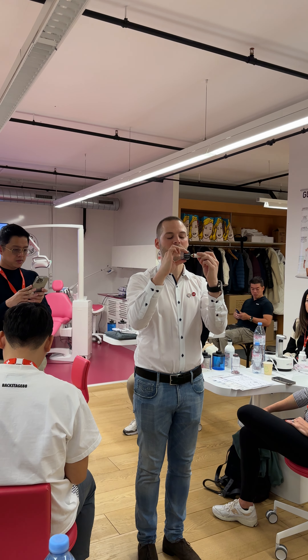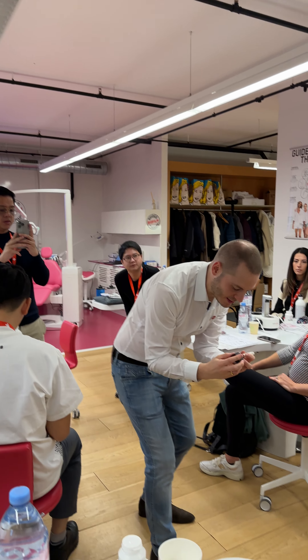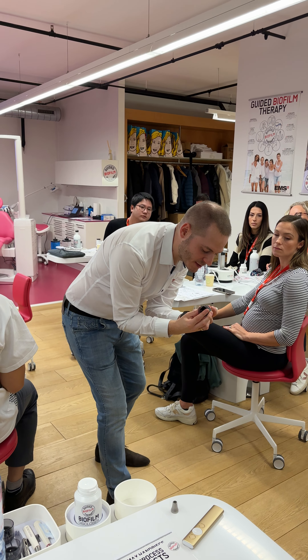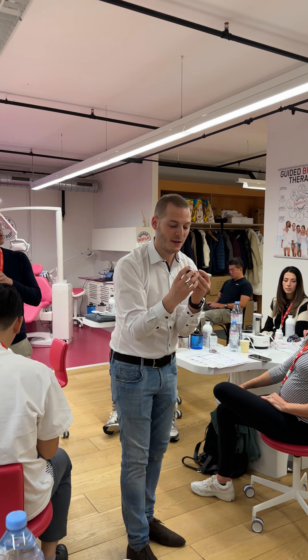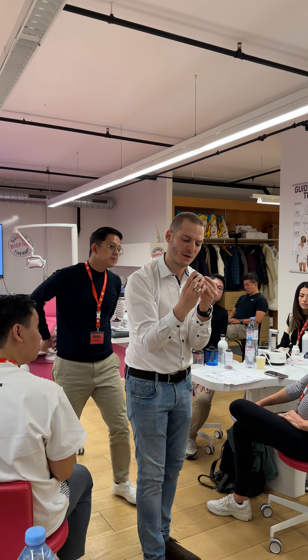Now when I push the instrument on top of that, I don't have a chance to reach the end. So I still have a distance here, because I have one thread with eight windings. So I can touch now the first two windings. So it tells me that my thread is healthy.